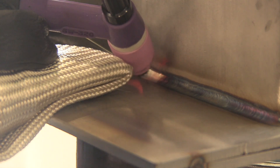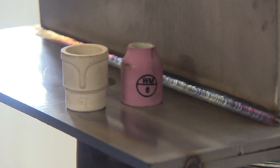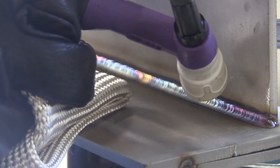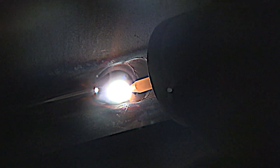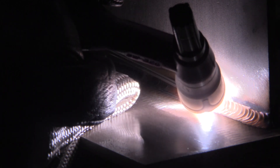The lay wire technique looks a little bit like that root on the pipe, doesn't it? This is just gliding along with a TIG finger just like you would on the root pass of a stainless pipe. I used a number six cup with a gas lens for that pass. For the second pass weaving over top, I switched over to a Jazzy 10 ceramic with about 20 to 25 CFH argon. The technique and motion is almost identical to the hot pass on the pipe - one difference being this T-joint can handle a whole lot more heat. So I'm at 150 amps here.